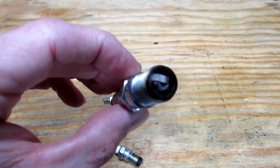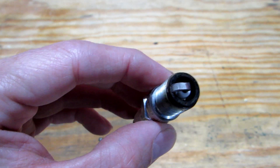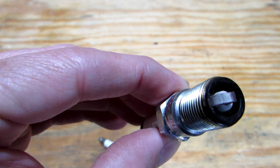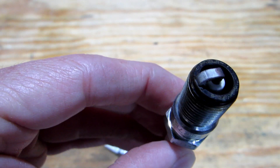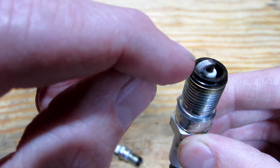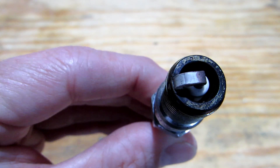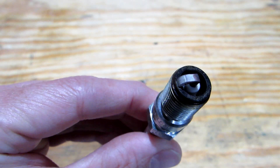Another thing is our timing mark. As this ground strap heats up and changes color, we can look for the point on the strap where the color changes — sometimes you'll get a nice line. You can see that line on the strap going across right at the edge of the bend. That would show that I could put some more timing in, as that line moves farther down towards the base as you add timing. You don't want it to go all the way to the weld; the middle of that bend is a good place to be. If it's up on the flat, you don't have near enough timing.